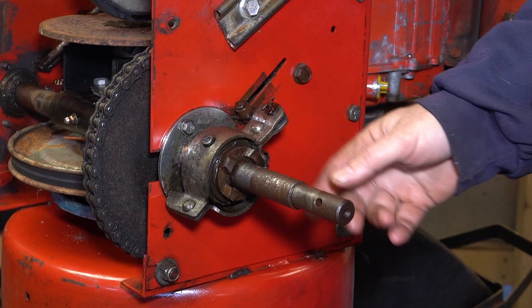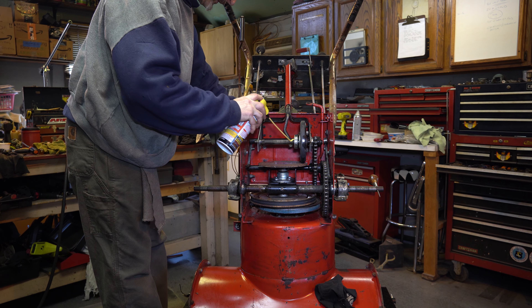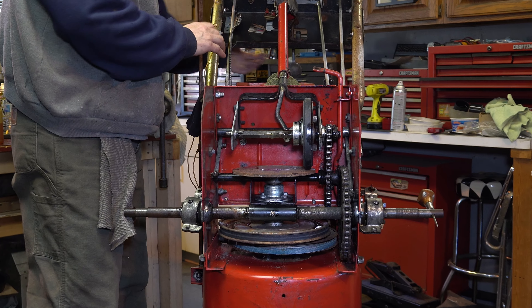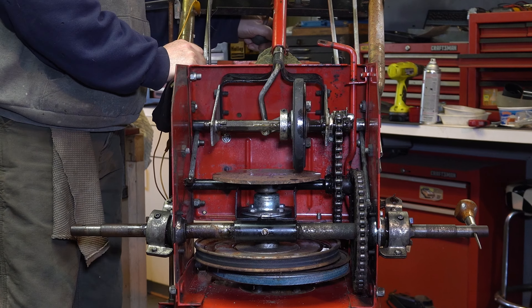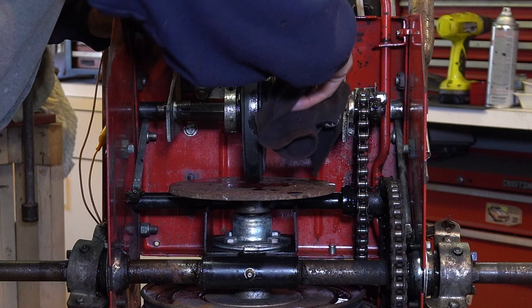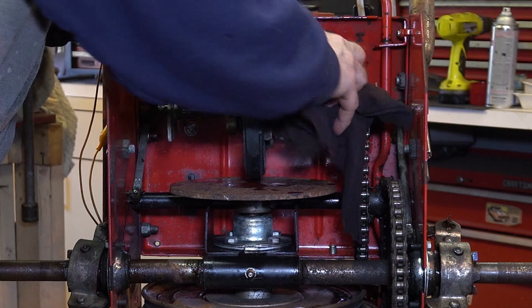Same thing up in here. I've been working oil in, but also penetrant. I'm not worried about getting oil or grease on this yet—we're going to be cleaning that. This thing's just a little bit stuck. Now it's starting to move. So we've got junk over in this area. If I have to wire wheel it all—whatever you can get wiped down and off, especially with a machine like this that needs a service like this—oil, penetrant, a little wire wheel action.